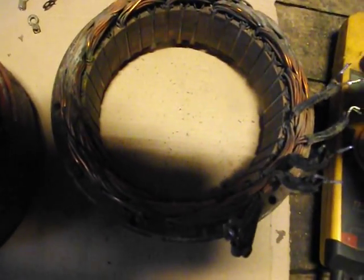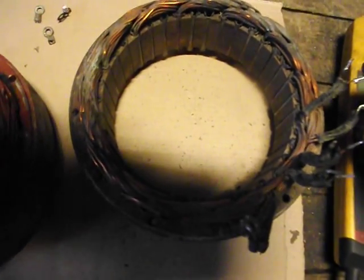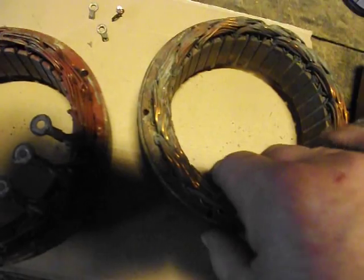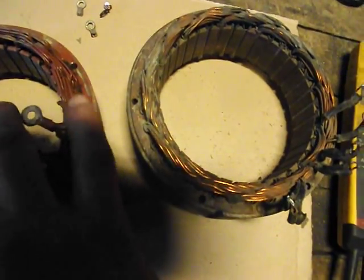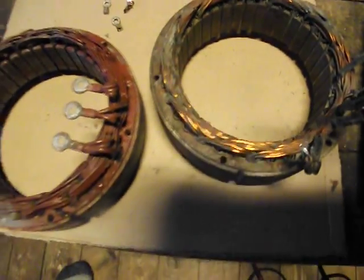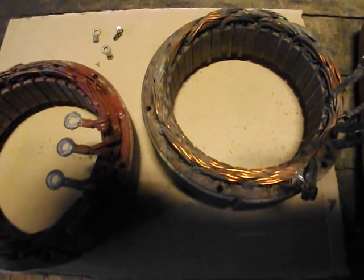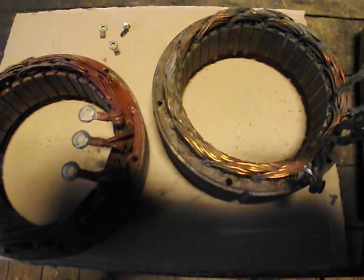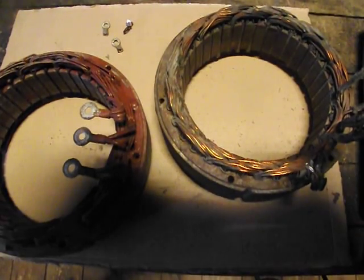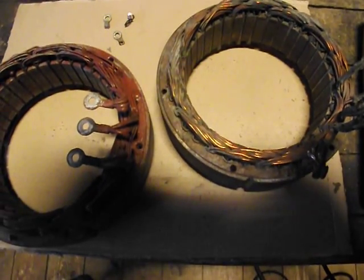You want everything to be isolated away from each other — that's the way it needs to be to work properly. If you have any kind of short, it's not going to work the way it's supposed to, and that's going to create a problem within the alternator or within an electric motor. Everything has a stator — electric motors, windmills, generators all have stators. Anyway folks, quick little video. I hope this bottom-line video gave do-it-yourself type people a better explanation than they had beforehand. Thank you for watching, and for those that have subscribed, thank you very much. For those that have not, please do so.